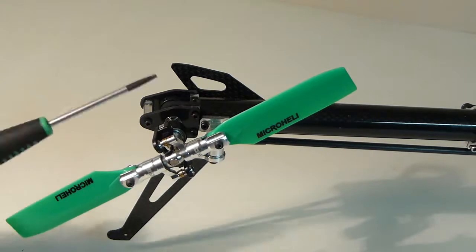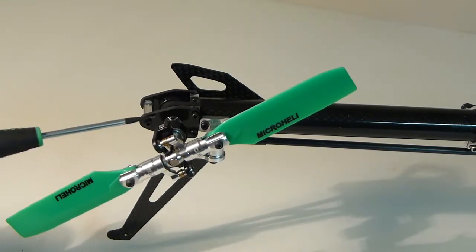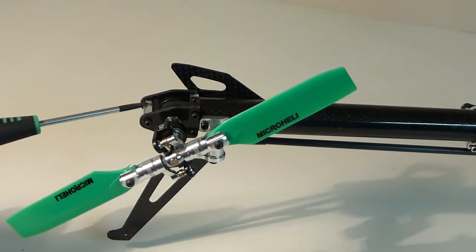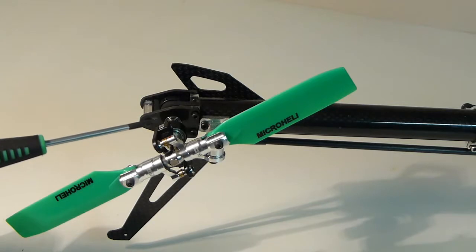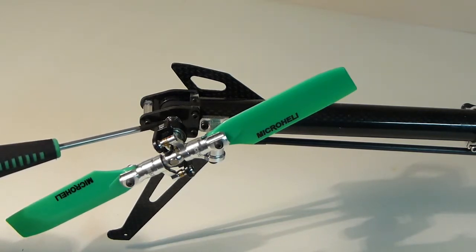The tail case uses Hawk RC side plates, which are a lot more rigid. It has a spacer so it's a lot stronger and reinforced. I'm also using ceramic hybrid bearings for the tail shaft — they're a lot quieter and run a lot smoother than the original bearings that came with the kit, which were really poor quality.